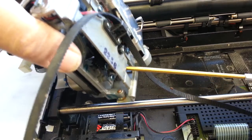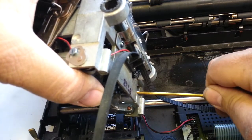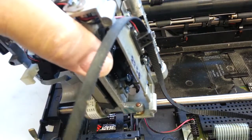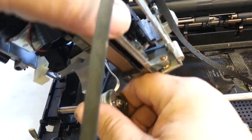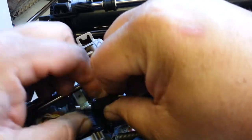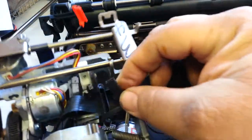These two screws go right into the impact solenoid plunger assembly. We've got number one screw out, let's get number two. Pack this guy out all the way, and then that solenoid will flop right out of here, like this. So the next thing we have to do is disconnect it up here so I can get it all the way out of the machine. This has the old style connection here, I can just separate without breaking it — there it goes.